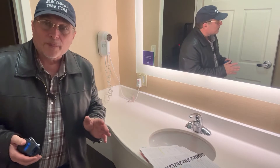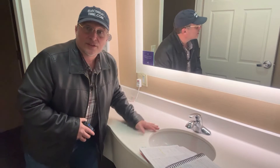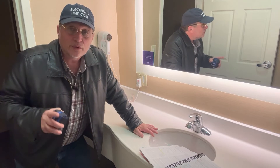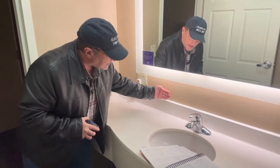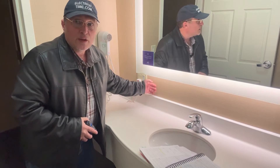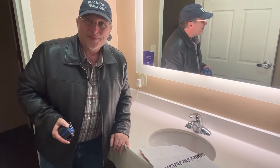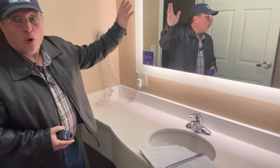The other thing I want you to think about: let's say you've got the height of the sink or countertop, and there's going to be a backsplash just like this one over here. Make sure when you install the height of that box, it's not in the middle of the wall and the backsplash. Ask the homeowner where they'd like this receptacle outlet. According to what we see here, that's going to be sort of the top of the backsplash — maybe go up two, three, four, five, or six inches. But let the homeowner decide the height, and don't go too tall because then you'll have an installation that might not be practical.